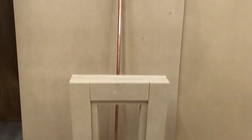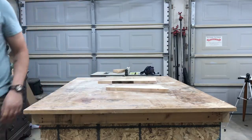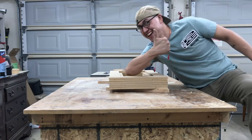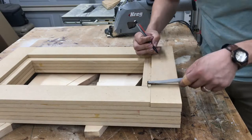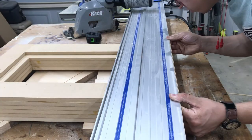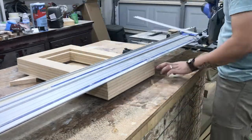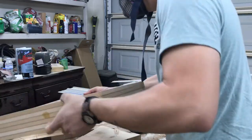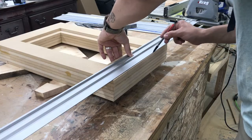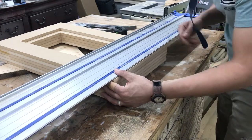This is the gist of how the lamp will look. Before cutting the base, I placed scrap wood on my workbench, gave it a little slap, measured and marked the desired distance from the inside, and cut it with my track saw. This could also be done with a regular circular saw and a straight edge. Since the blade isn't long enough to go through the entire thing, I cut it in two passes, transferring the lines to the opposite side with a speed square. I did this to all four sides.